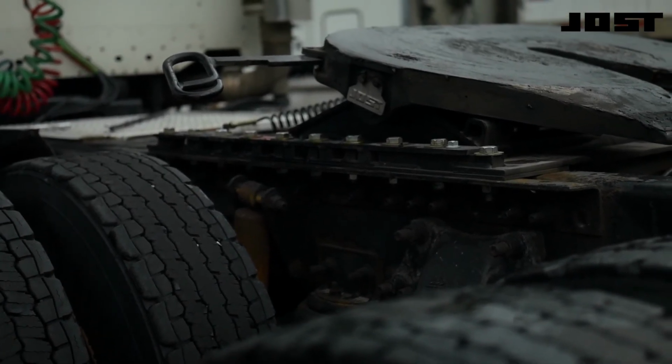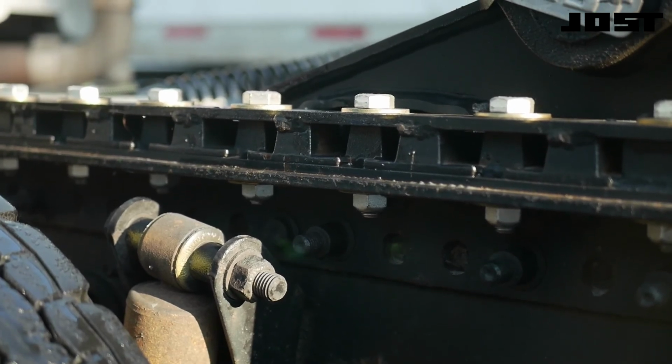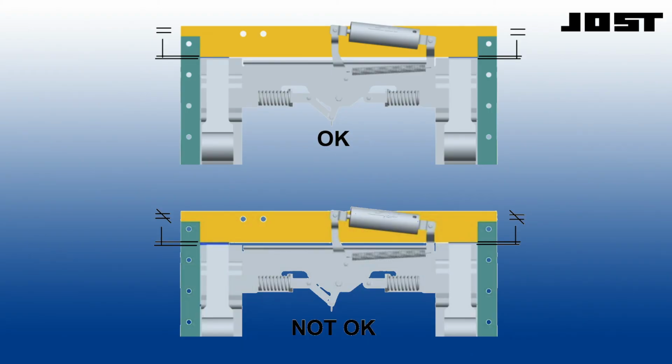Inspect that the locking plunger teeth are aligned with the rack on both sides. Aligned locking plunger teeth will engage the rack. Cycle the locking plungers to confirm alignment. Confirm the slide bracket is square. Release the slide bracket. Slide the bracket against the front slide stop. There should be no gap between the slide bracket and the front stop.